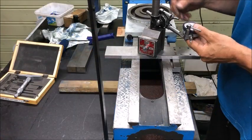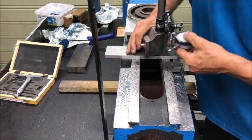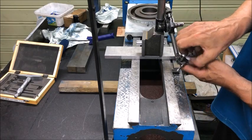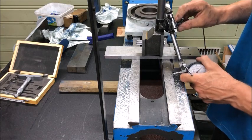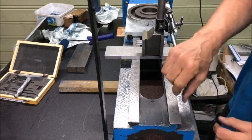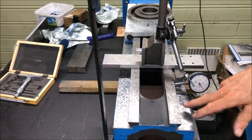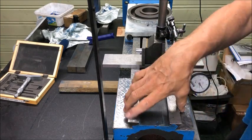I also forgot how I prepare for the test of the column when it is standing by itself, and then the sideways tilt — namely to have some sort of reference for that also. To do that, I can use these small ridges here, which you can run the indicator to, in this case to the dovetail here, so you know that these are parallel.